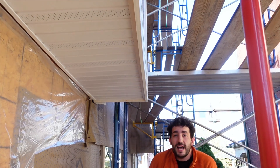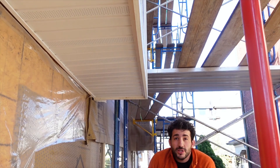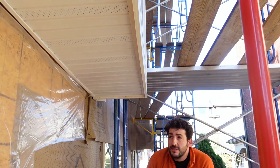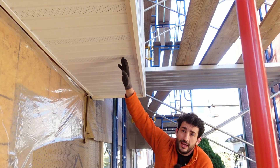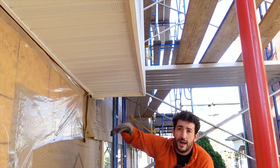In this case, we're replacing everything with siding — partially for budget, and partially because we really don't believe in stucco systems on top of a wood-sheeted house. This is a vented soffit. These holes actually let air in to dry wood out and let moisture out as well.